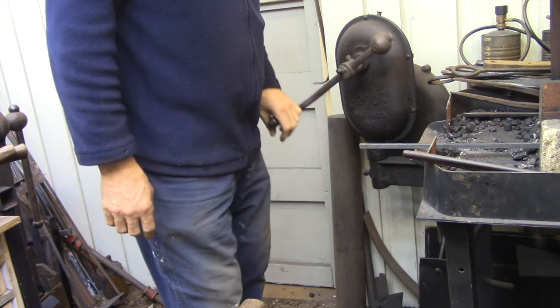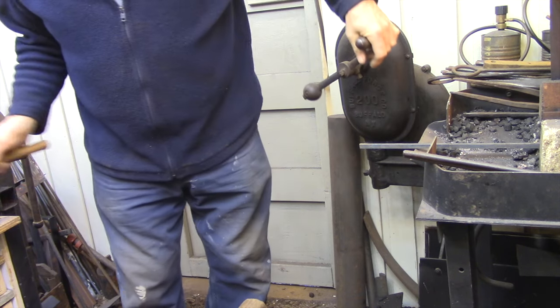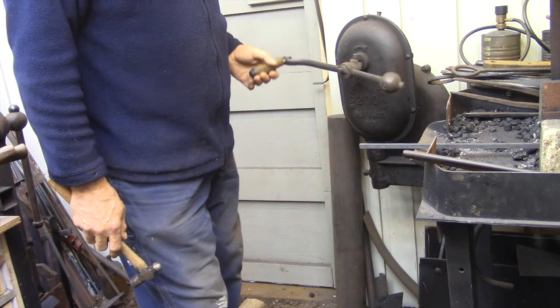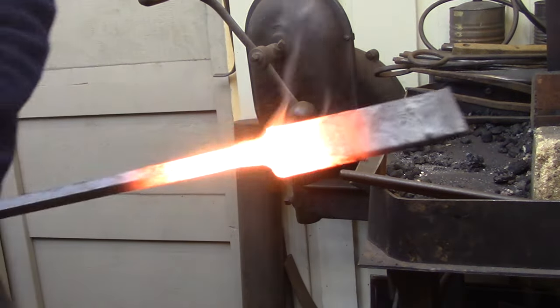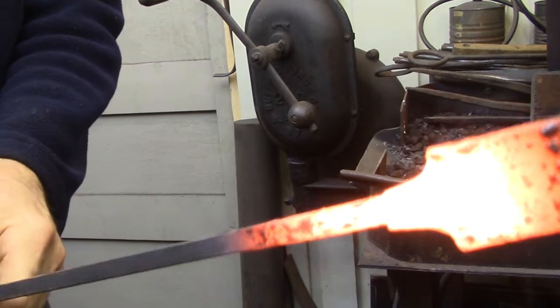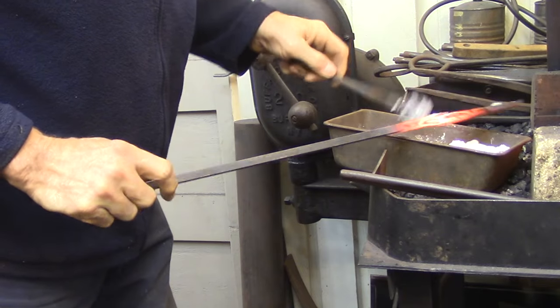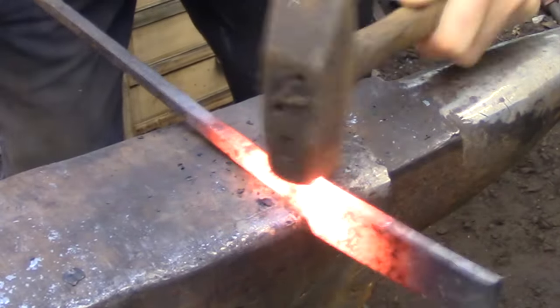It's a few minutes later and I have a welding heat. Now you finally get to see the point of all this. If I had to take these two separate pieces out of the fire and weld them conventionally by trying to lap them on the anvil with a drop tong weld, I would probably have a 1 in 3 chance of getting it done. But because I'm using a cleft weld I can actually set the weld in the fire, take the piece out as a unit, and go straight over to the anvil and finish the weld. By taking a little extra time to set up the weld I can increase my success rate dramatically.